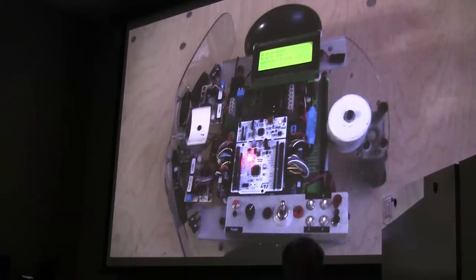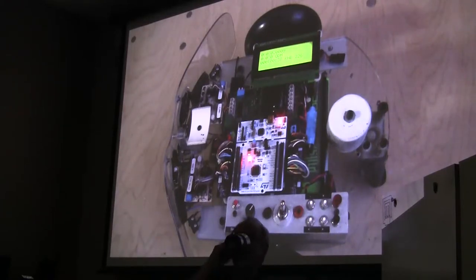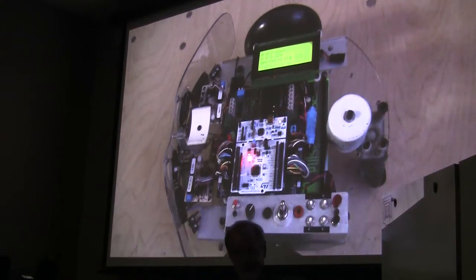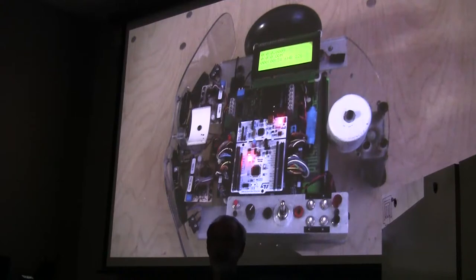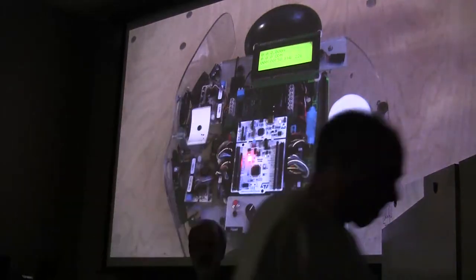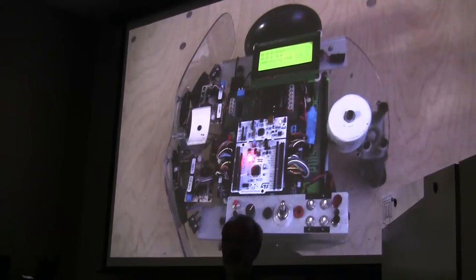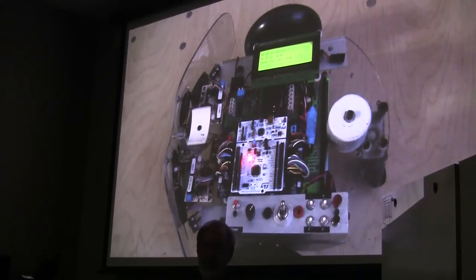Dave, I'm not sure I understand how you keep this over reset. You mentioned it, but I guess I didn't catch something. Okay, in the startup code, if you're familiar with C, that's usually called CRT.0. It's almost always written in assembly language. And that startup code for all C compilers pretty much does the same thing. It sets the stack pointer and program counter, and it clears memory, the BSS segment, and it copies the read-only segment from flash into RAM.